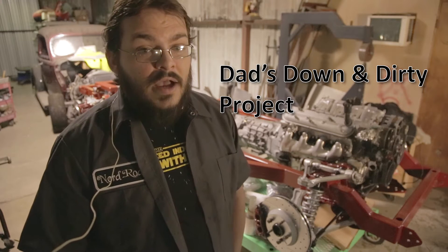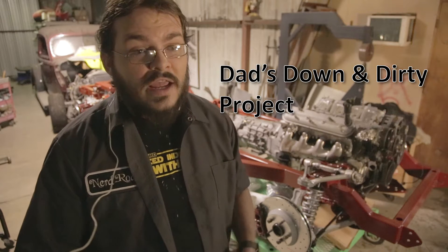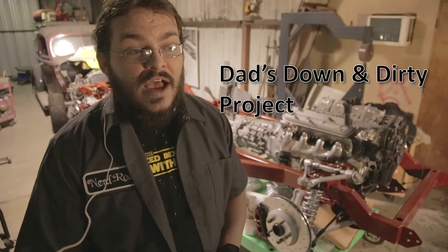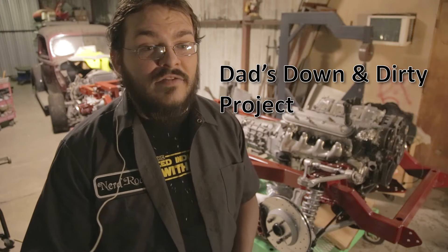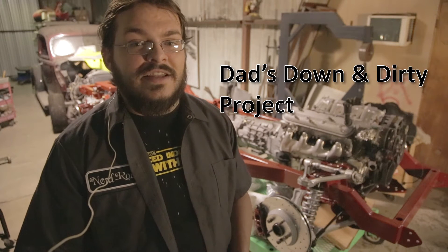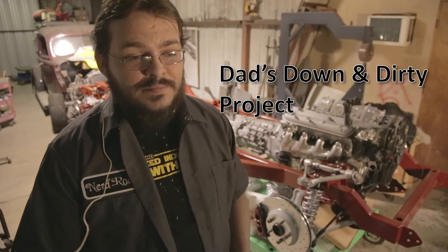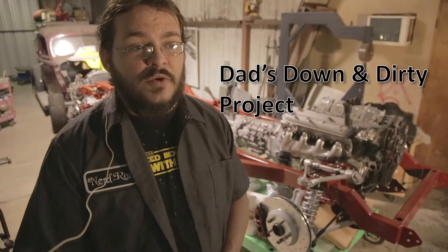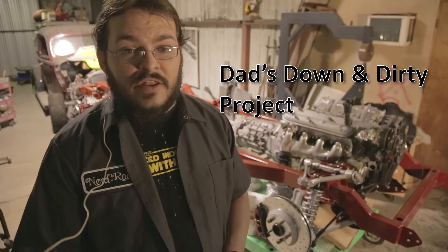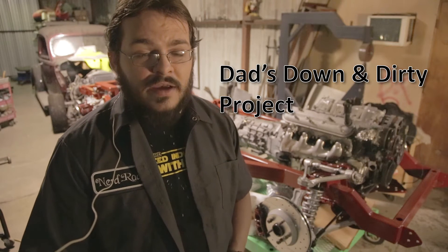So we've got the frame here behind us — Dad's D3, Dad's Down and Dirty Project. It's evolved a little bit. It was going to be a 5.3 automatic, whatever we could get our hands on. Then I realized I had a Dana 44 Corvette differential that already had 4.10 gears I wasn't using, and a T56 transmission that wasn't going to survive the abuse I had originally planned for it. I had a lot of stuff laying around, so it became a case of 'here Dad, take this' over and over. The projects moved up quite a bit. The final straw was I found an LSA supercharger — turns out those things are pretty cheap right now. I was going to put that supercharger on the 5.3 to give him some extra ponies since he already had the differential and transmission to handle it.